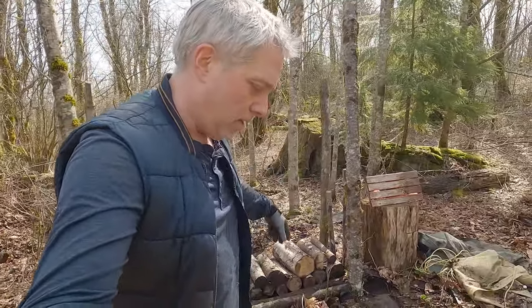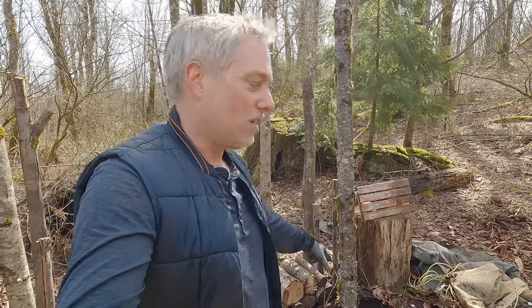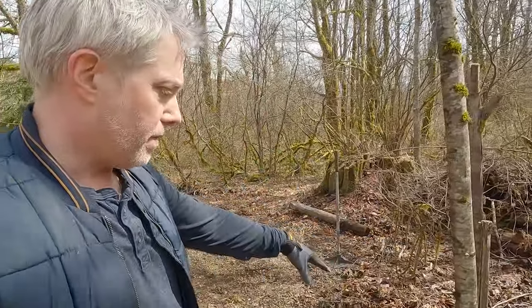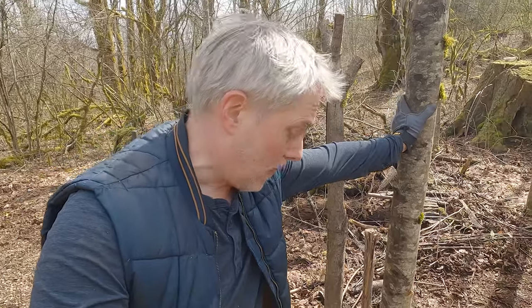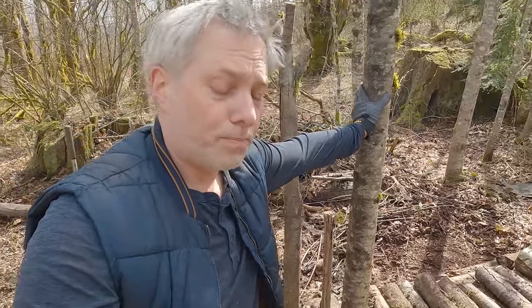So this is alder, which is even worse than maple for its survival rate in contact with the ground, in contact with just air. Basically, it starts to decay the second you cut it. What I'm going to do, I didn't do this before, so that maple had survived in the ground 2.5 years without even any gravel in the hole. I literally just dug a hole with a post hole digger in the soil and shoved the maple post into it.